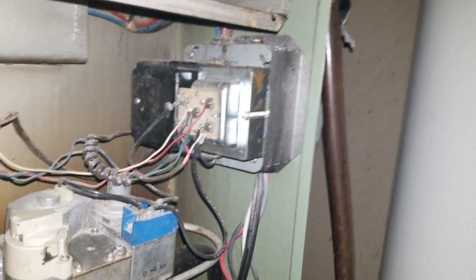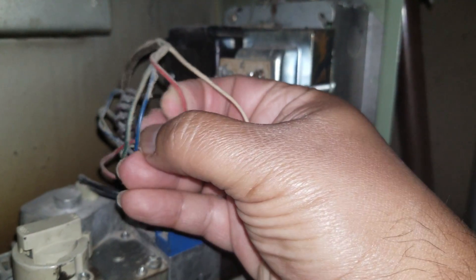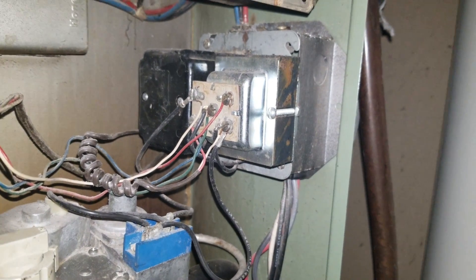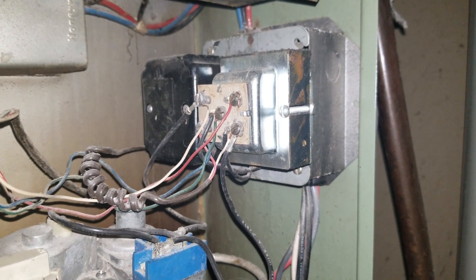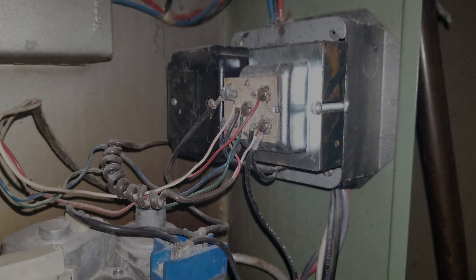All right guys, a lot of furnace sounds down here. So hang tight — like I said, this is ad hoc. Here's our wiring right here. It looks like this is a really older system — it doesn't have a board with it — but our wires for our thermostat seem to be coming right here. You've got your green, your blue, your red, and your white, and they go right into this guy. This is probably giving us 24 volts right here. What we're going to do is get the adapter, get it wired into here, plug these into the adapter, and then go back upstairs and finish the Ecobee.